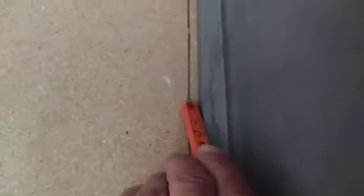Once you receive your sink and place it in the center, you're going to scribe with your pencil. I always use the pencil like a standoff so I can get the mark that I want, roughly about 1/4 inch around the perimeter. The reason is that when you Bondo this in and fabricate it to the wood, you're going to pack fill that with Bondo, which you'll see in the next step. Once we establish where we're going to cut our countertop, it's safe to remove your sink. That will actually be your cutout in the countertop, so we're going to do that first.